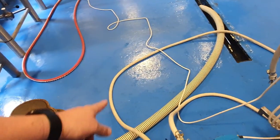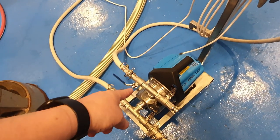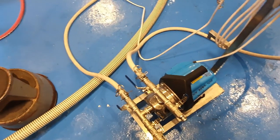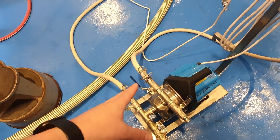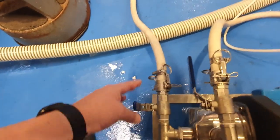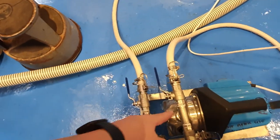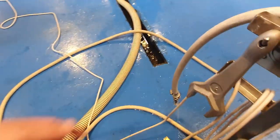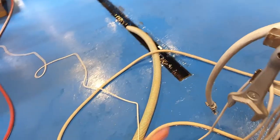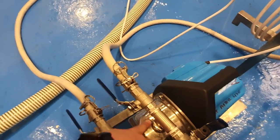But first I like to make sure that I've rinsed my pump out, particularly if you're using one of these Clark pumps, because it does have a brass fitting on the inside which degrades — I buy extra impellers for these so I don't have to buy a brand new pump. It's also worth bearing in mind that if you leave your acid in there, it's going to break your pumps eventually. This is connected to my IBC of fresh water, and I'm just going to open that valve — you can see it's running into the pump housing and out of what we had attached to the spray ball.